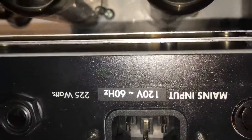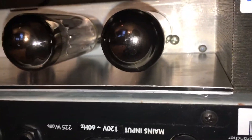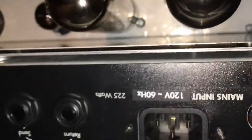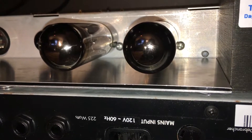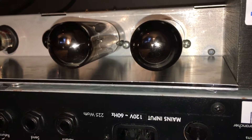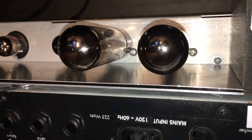I'm hoping that having two air gaps instead of just a single air gap — because I've seen a lot of other people just put a single plate of aluminum in there — I figured I'd put another air gap in there just to help dissipate the heat that much more, and it should solve that issue because I'd rather not have the filter caps on this thing cooked by these power tubes.